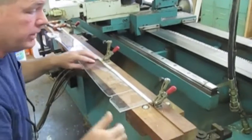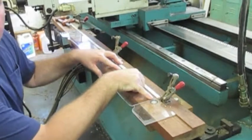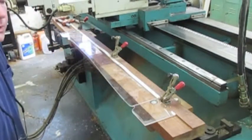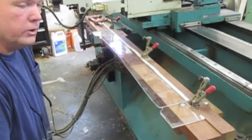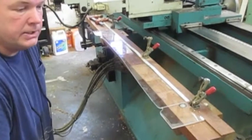When you end up doing a turning, you're simply going to align the template to the zero mark, which represents the face of the headstock, clamp it down in that position, and then you can end up adjusting the position where you want your knives to start and end. There are stops on the other side, and I'll explain how to set those up later.